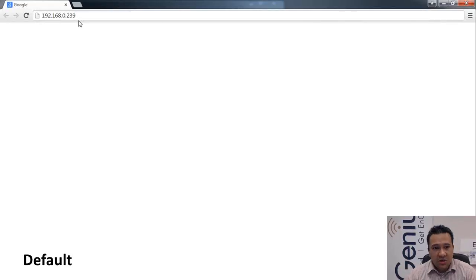Well, the EWS controller module, which is inside the switch, is a web-based interface, and the default IP address for an EWS switch is 192.168.0.253. So this is how it comes out of the box, and just using a browser to go into this web interface, we type in the address, and then we come to the next page.